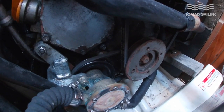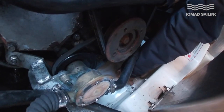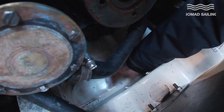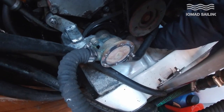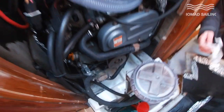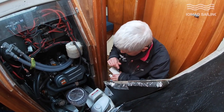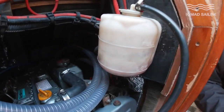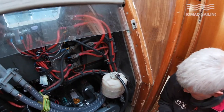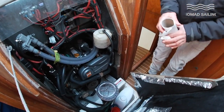The second B is bilge. This is the bilge area under here. We're looking for a nice dry, clean bilge. When we do our engine check each morning, if there's anything in there we address it. If it's black it's oil, if it's pink it's coolant, and if it's just water then we'd need to check our water cooling system.